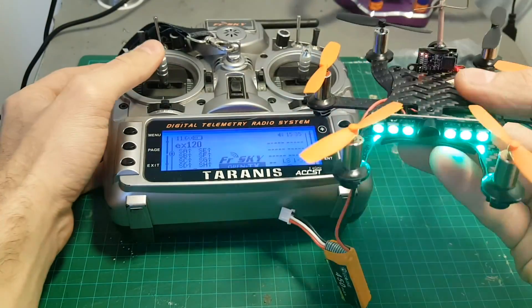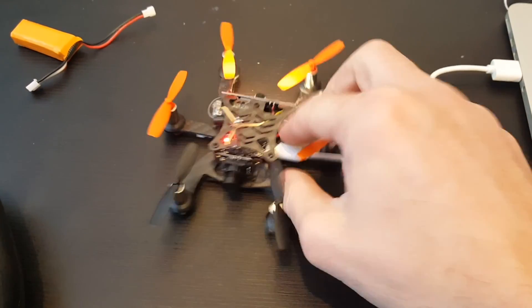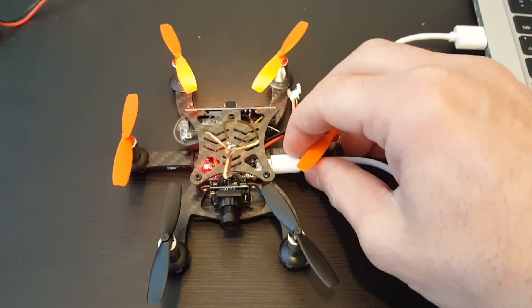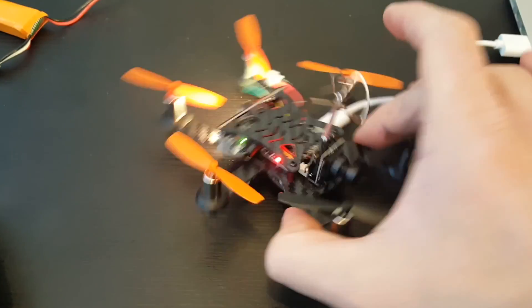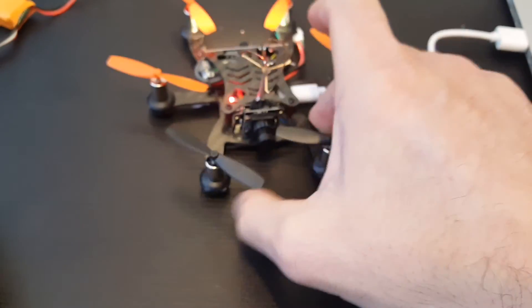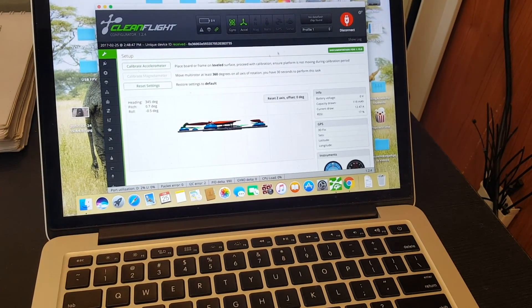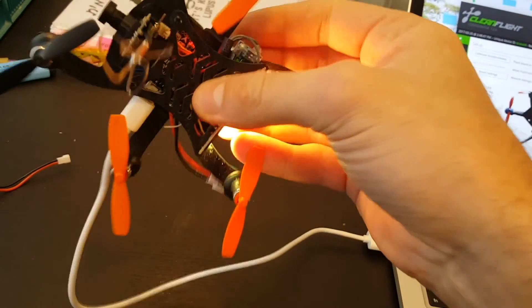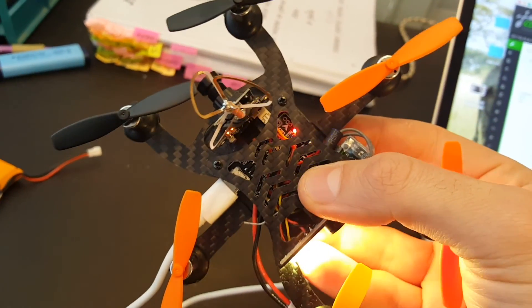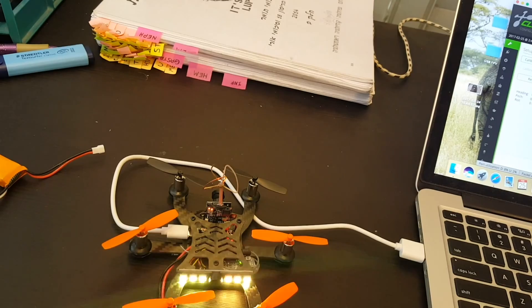You can see that moving the stick changes things, but we'll have to configure it in CleanFlight. Configuration is done via the USB port on the side — you don't have to plug in a battery to power the receiver, which is a good thing. You can also change the camera's frequency when connected via USB. I recommend backing up the settings before making any changes, in case something goes wrong. The flight controller direction is not normal — the front is switched — so it's important to save a backup.